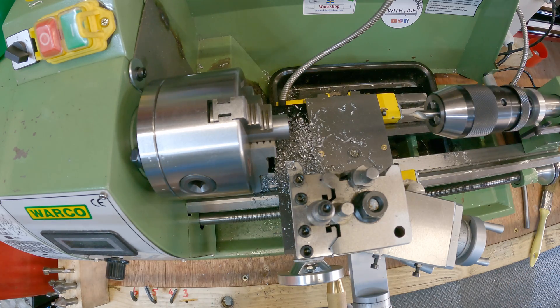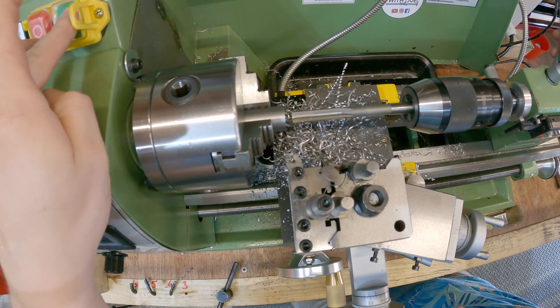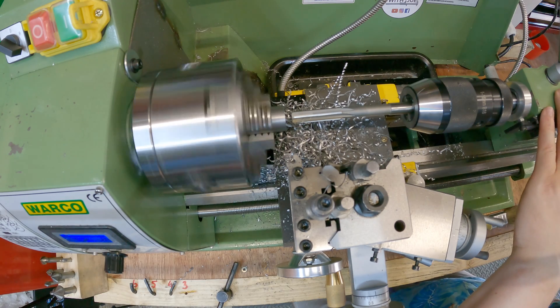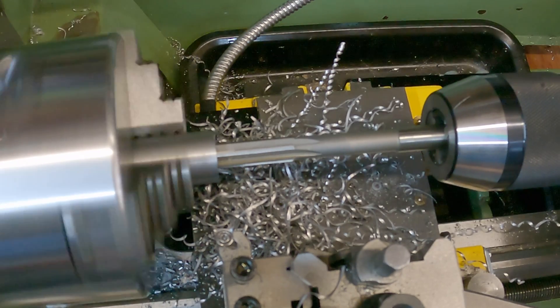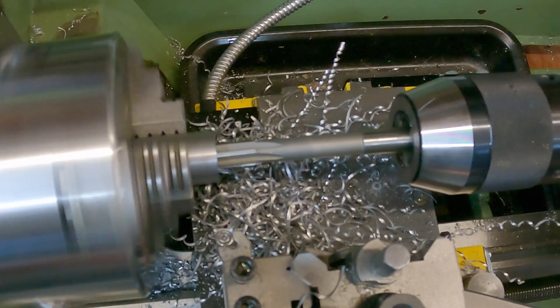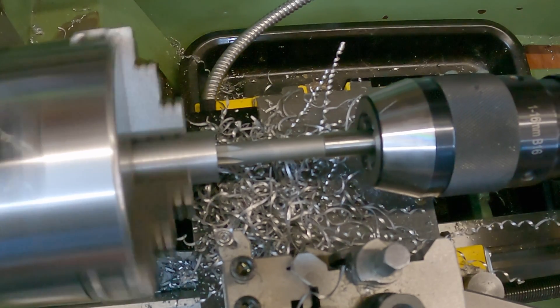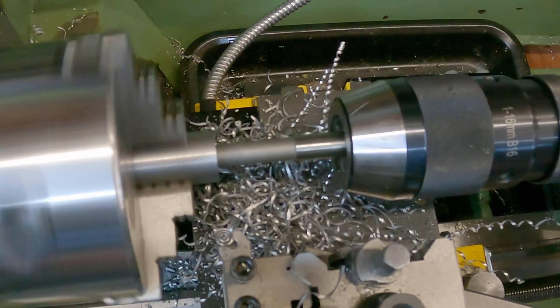As this is going to take a little bit of time, I'm going to come back when I've got it all drilled out. The only thing I've got left to do is ream it — I've got my 10mm hole drilled 50mm through, and I'm just going to finish it up by reaming it out. This should hopefully clean up any rough bits from the drill and make a really accurate 10mm hole — even though we really need a 10.2, 10mm is going to be good enough.